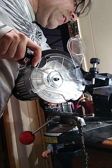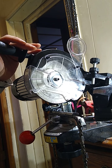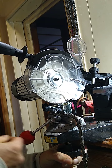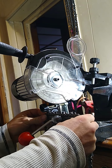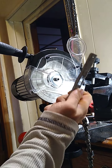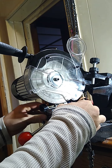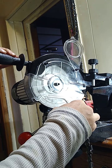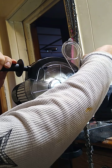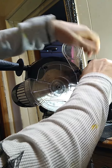First, you adjust this wheel to 90 degrees — up and down. Then set it to zero degrees — back and forth. You've got your depth gauge here for your rakers. This one works pretty good. Just bring her back and check your depth, set it with this depth gauge here until the pressure is just barely off your depth gauge.